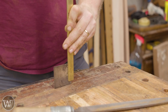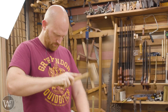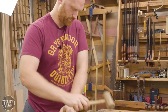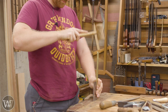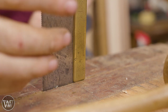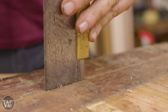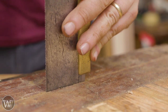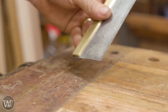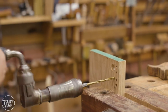To put the back back on the blade you can't just pound it straight down — you have to pound it in from the end. It takes a little bit of time; you have to do it step by step. Do not push it too far otherwise you'll bend the blade. I'm only moving it about an inch, tapping it down that inch, then lifting it up another inch and tapping down until I get close to the end, then we can tap it down the rest of the way. Don't rush this — don't bend your blade and have to start all over. This one actually went a little past the tip so I had to hang it over the bench a little bit and tap it down.